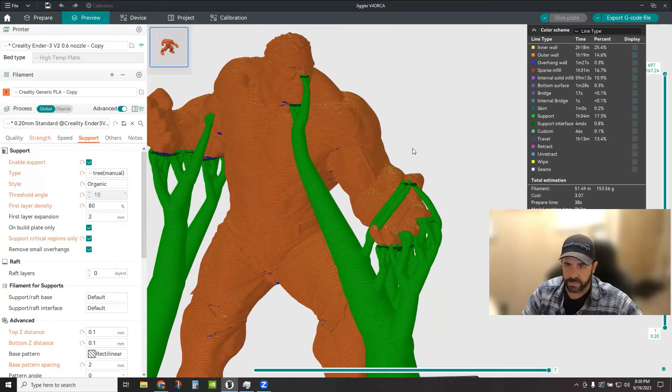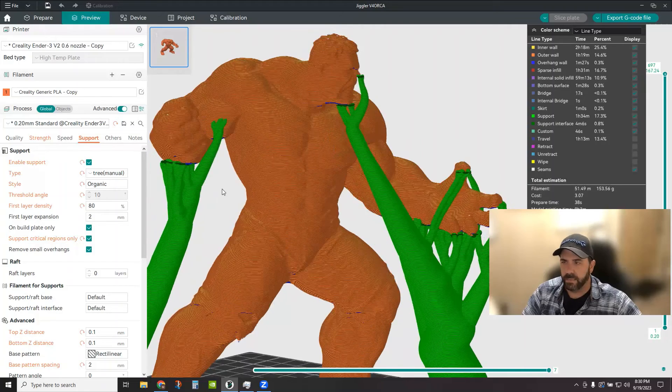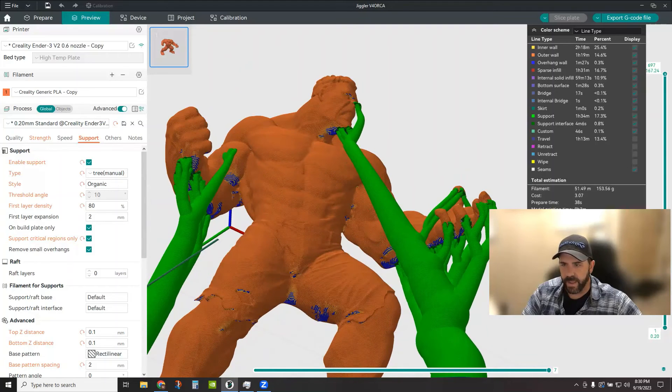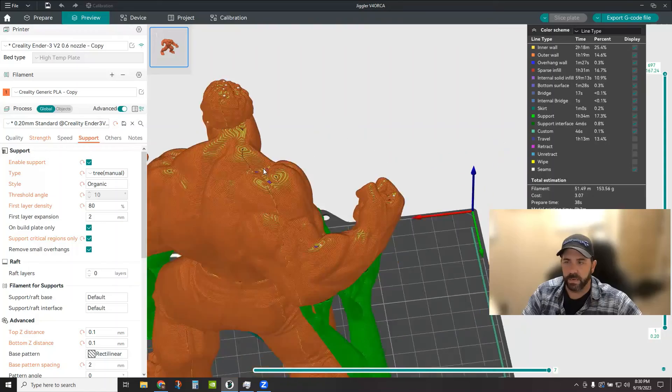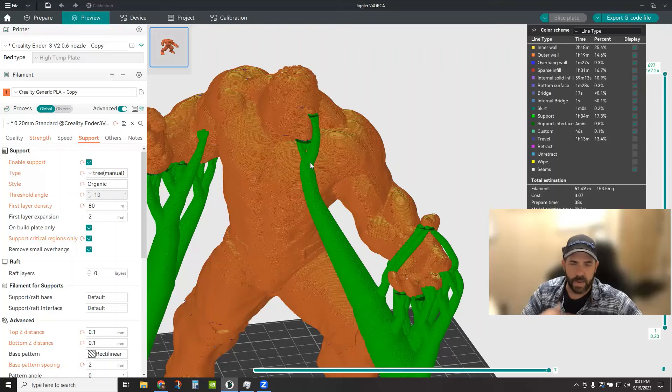The dark layers are your interface layers — they're there to hopefully make these things pop off a bit easier. I don't think it's ever really going to pop completely clean. Your support interface settings may be more dialed in than mine, but with any organic structures like this it's going to be tough and you'll have a bit of cleanup to do. The nice thing is it does let you identify in the preview those dark bluish-purplish areas where the software is still telling you hey, maybe consider support — and you can make the judgment call on whether you really need to act on that. Like under his eyebrow right there — it's not required for my printer.